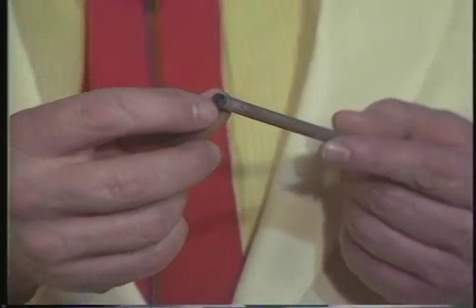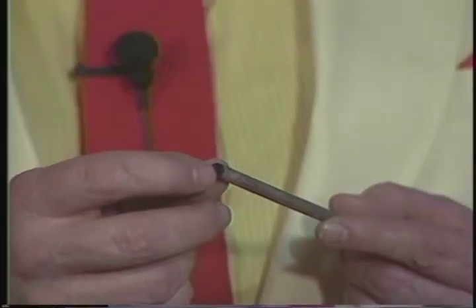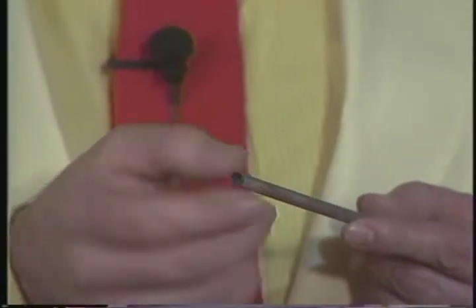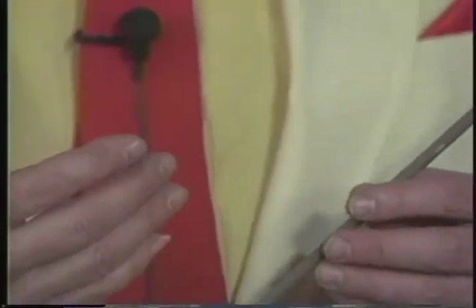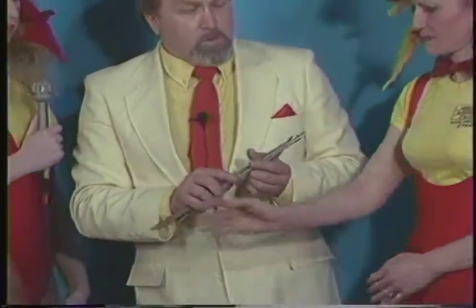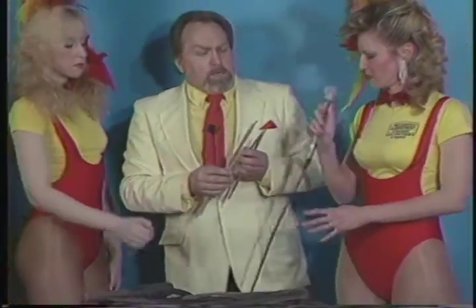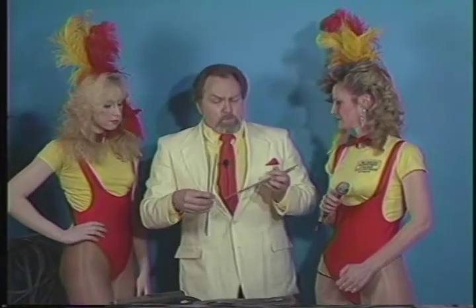Right in the very center, you can see where the steel, the filler rod is, and this on the outside is the flux, okay? The real science in stick welding is the flux. And these things, they make literally hundreds of different kinds of electrodes for a variety of purposes. This is a regular mild steel electrode, and it's different from this, and I'm going to explain both of these and show you guys both of these. This one happens to be contact rod, and I'm showing it because it's an excellent beginner rod. So we're going to show that.